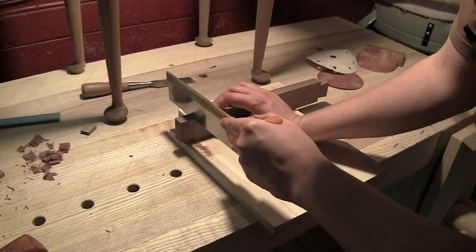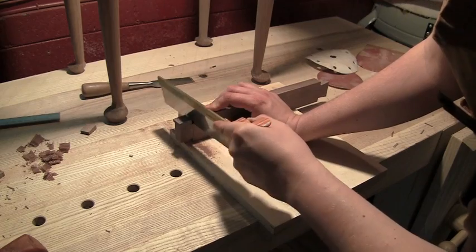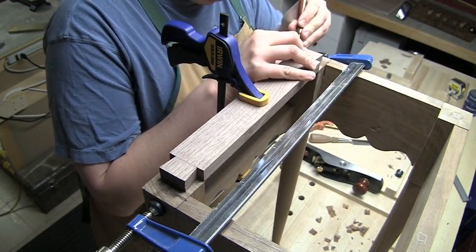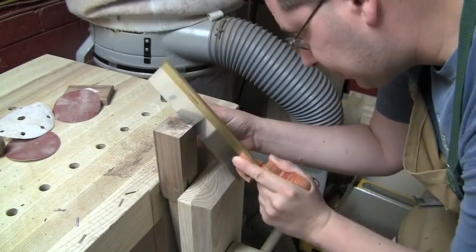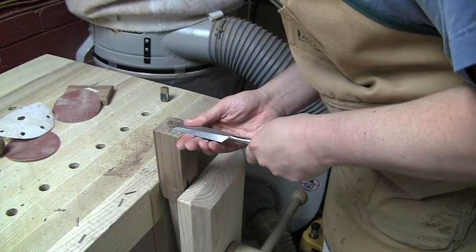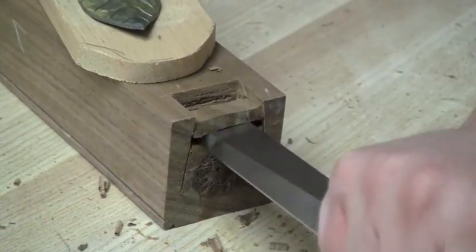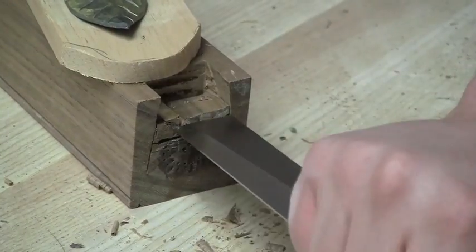Now I'm going to turn my attention back to the top rail and I just need to cut the dovetail and get it fitted into the top of the carcass. Just here at the bench hook cutting the tail parts, and I'll take it over to the carcass. I've got the front clamped so that the aspect is square, and then I'll mark my pin locations just using a marking knife. Pretty simple work, but you want to make sure your marks are deep so you can see them. I'll make my cuts — this is really just following the lines — and take a chisel to knock out just a tiny little bit up to the marking line on both the end grain and on the face grain. This gives me somewhere to register my chisel against as I begin to chop things down. Here we go into high speed chopping through the entire thing, basically wasting away everything in that socket getting ready to fit the pin.